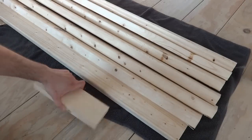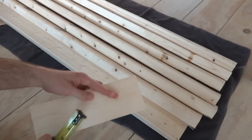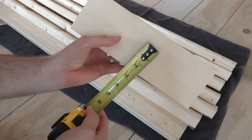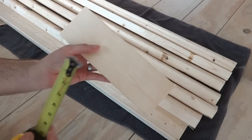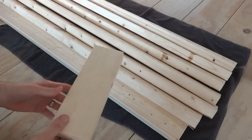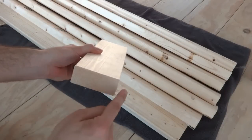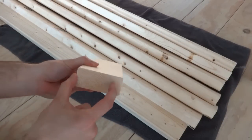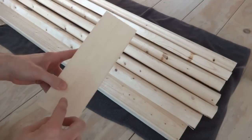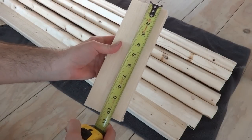One of the main things you need to know is the dimensions of the board. If you're a total newbie, 2x4s don't actually measure 2 inches by 4 inches — they're actually 1½ by 3½. This 3½ dimension is really important. An official set of Jenga pieces is made of 54 pieces, laid 3 across. So three pieces of 3½ inches each gives us 10½ inches. Our pieces need to be cut at 10½ inches.